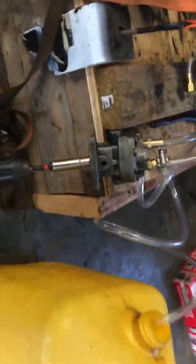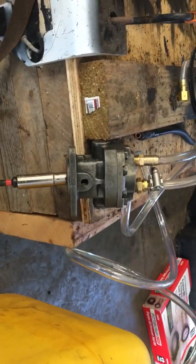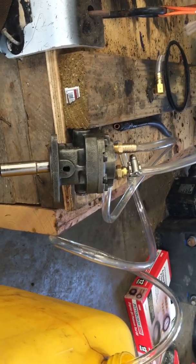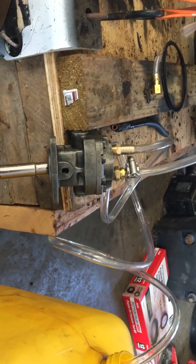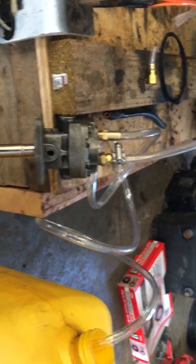Here's my Detroit fuel pump with two new seals in it. They're shaft seals, and that's where it was sucking air from before with the old seals. I put two new seals in and it's not sucking any air or pushing it through the fuel system anymore.